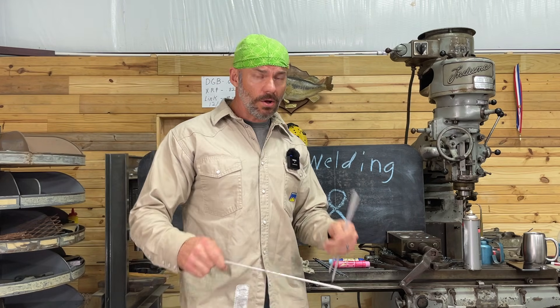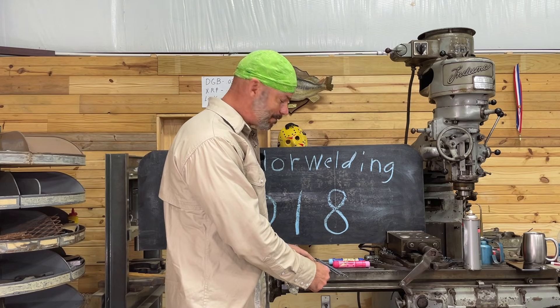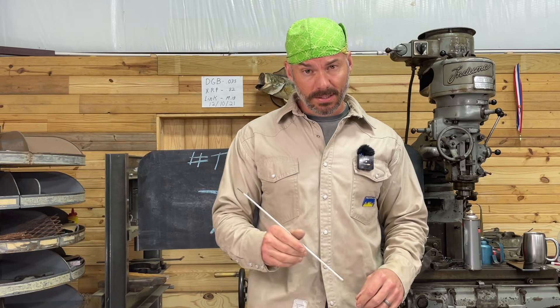You're only worth the value you bring. Now let's talk about when I laid this rod on the table — there's oil and contaminants on the table. If you get some oil inside of this rod, it is no good; it will cause all kinds of problems. Porosity being the main thing — a little bit of grease, porosity. If your rod's got a big chip on the edge and you just fire up and start welding, you're going to have porosity in your starts. That's the biggest problem with 7018s is porosity. I had a problem with my welding machine — it was porosity from top to bottom, in the middle, driving me crazy. Changed my heat box, went away, haven't seen it since.